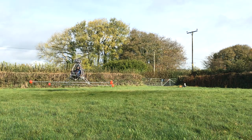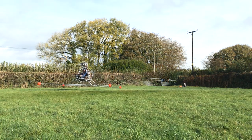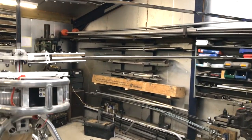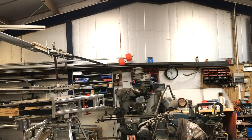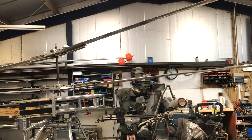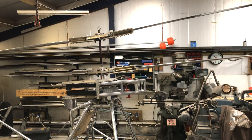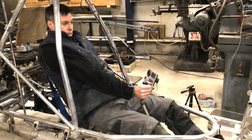Here is my understanding of it. When the rotor system encounters an oncoming gust of wind, the advancing blade experiences more lift than the retreating blade. But instead of the rotor tilting to one side like you might expect, it tilts around 90 degrees later due to aerodynamic precession, and therefore backwards. With coaxial and counter-rotating blades, the result is the same on both rotors — they both tilt backwards together.